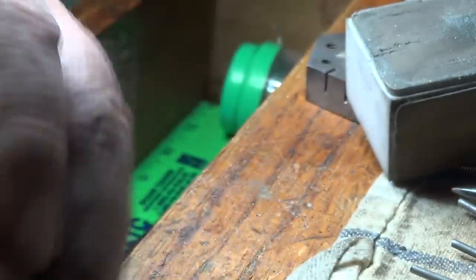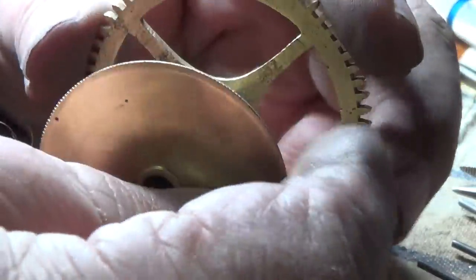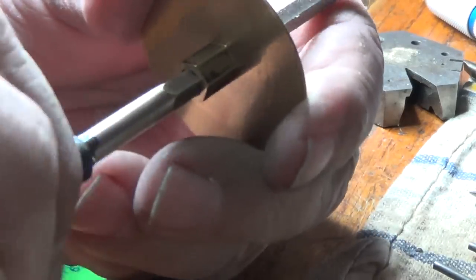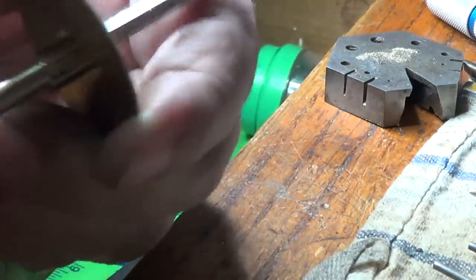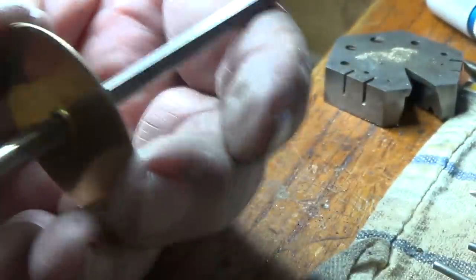Attached again. Now, next thing you do, take one of these. Well, I better check the fit. I'm going to have to redo this. See, it closes that up. So I'm going to take a broach and go down with the broach again. All that hammering kind of compresses things and does close the hole up. Okay, so open it back up again. But we're going to have to do it again when we pound the other side, so I'm not going to be too fussy with it.